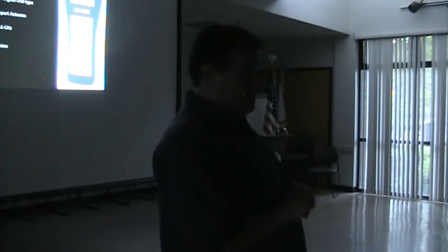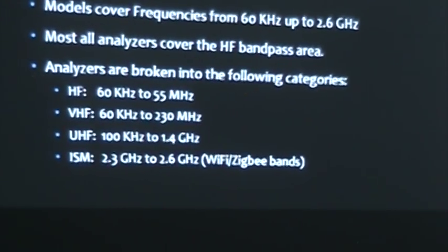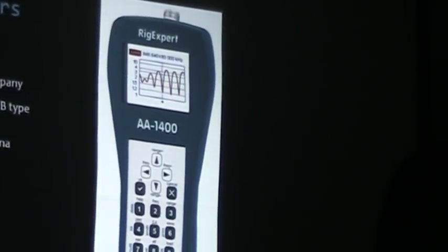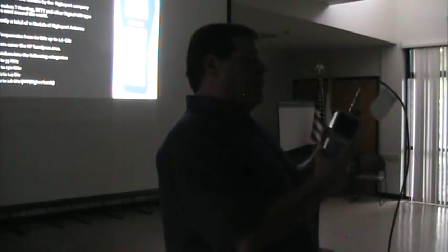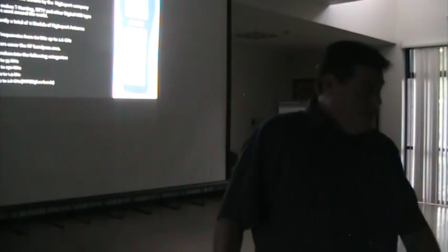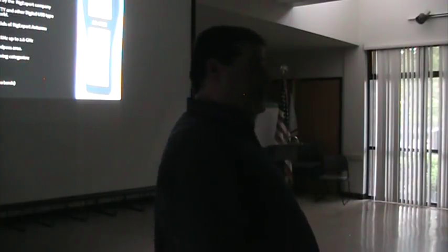Analyzers are broken down into HF (60 kHz through 55 MHz), VHF to 230 MHz, and UHF with three models: the AA600 to 600 MHz, the AA1000 to 1 GHz, and the AA1400 to 1.4 GHz. The AA1400 has a more industrial design — a metal plate on top where the N connector is mounted — it's more robust and larger in the hand compared to the consumer-style AA230.